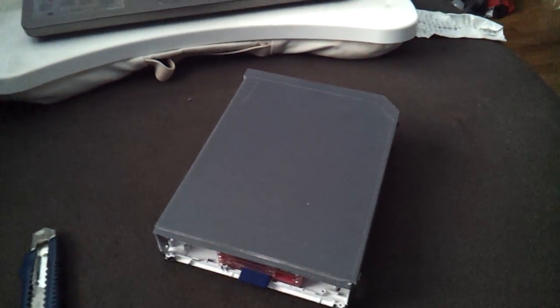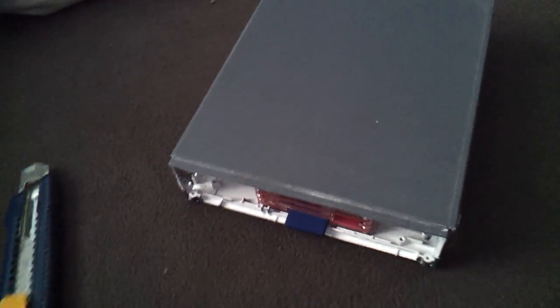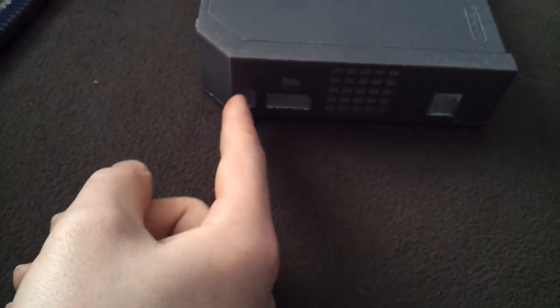There's a spot for a fan, because the original Wii does have that, but I'm probably not going to put a fan on because it sucks too much power. Everything is pretty much going to be self-contained inside and then run to the back — one USB port. This is the power; I'm going to leave that as power and stick a female 5V micro USB sticking out there.